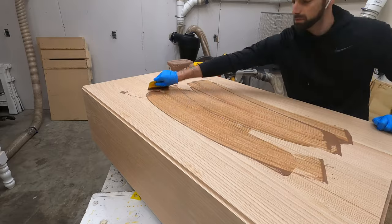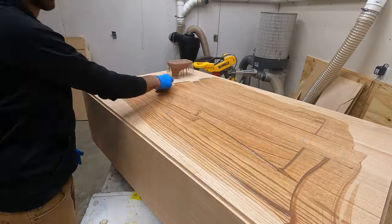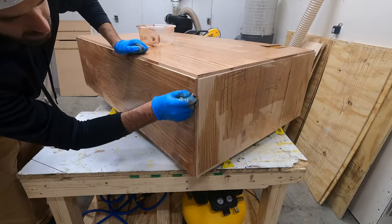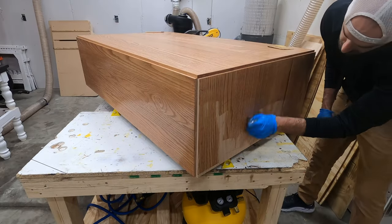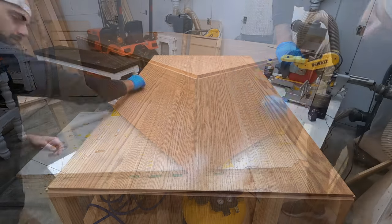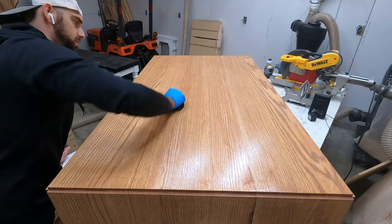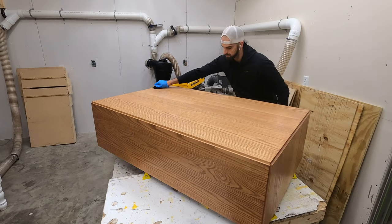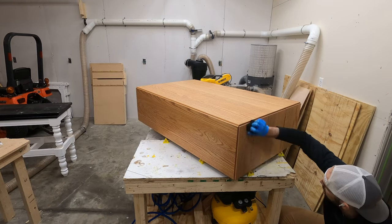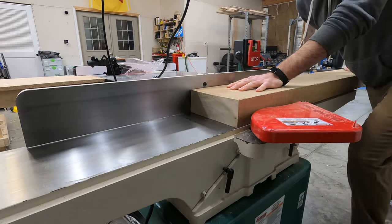For the finish I chose to use Rubio Monocoat Bourbon. I know it has a high price point sometimes, but I used the 100 ml bottle which is 20 bucks on Amazon not including the hardener. Regardless of price, Rubio Monocoat is so easy to use and it gives me a much better finish than anything else I've used. Unless you want to put the maintenance oil on, it really is only a one coat thing — no multiple coats of polyurethane with sanding in between. You put it on, you wipe it off, and then you're done. I am not sponsored by Rubio, but in all seriousness it is a great finish and very easy to work with.